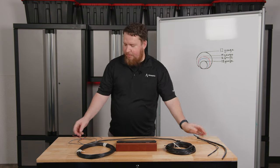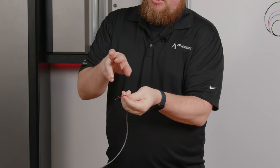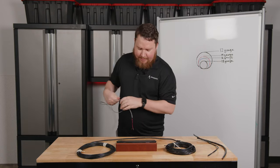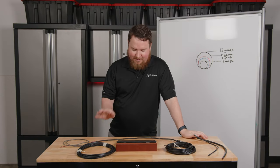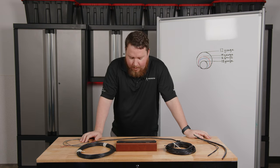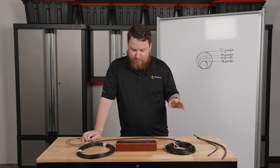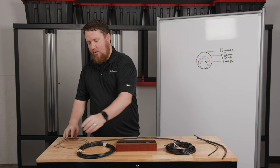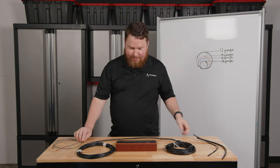We also recommend going with twisted pair wire. I've stripped back the outer gray jacket on this wire so you can see further back — you'll notice the two strands, the black and the red (or black and white in some cases), actually roll over on themselves. That twist prevents electromagnetic interference. It keeps us from getting crosstalk, and I've even heard stories of long untwisted wires picking up FM radio stations. The side-by-side flat wire is the alternative, and you might find that in some home entertainment packages, but it's not recommended because it lacks the twist that helps avoid noise and interference.